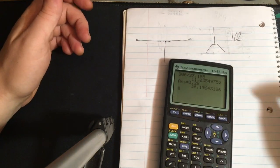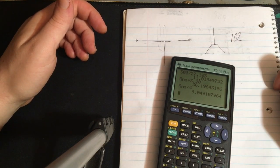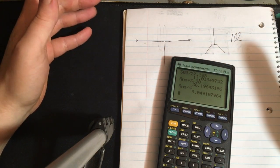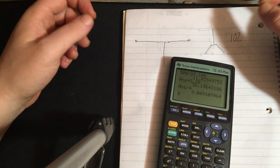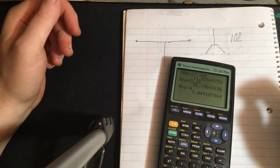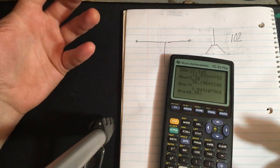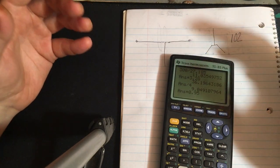So what we do is we divide by 4 and we get 9 feet. Okay, but we have to take into consideration the velocity factor of the medium. Now, the velocity factor will be lower in a wire than it will in free space. So let's go times 0.95. You can't really go wrong with 95%. That's about the velocity factor for copper.